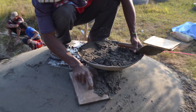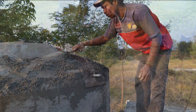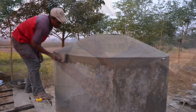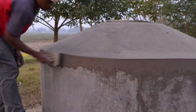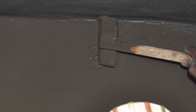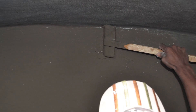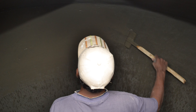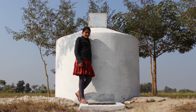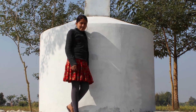In the next stage, we can then plaster the roof of the tank using just one coat. Special care should be taken with this section as gravity is working against you. If needs be, take a day each for the exterior and interior coating to allow time for the concrete to set. Finally, using a brush, remember to apply a cement and water layer to the entire inside of the tank. This helps to protect the concrete against moisture penetration. At this point, congratulations — you have now completed construction of your tank and all that remains to do is give it a nice exterior coating of weather-resistant paint.